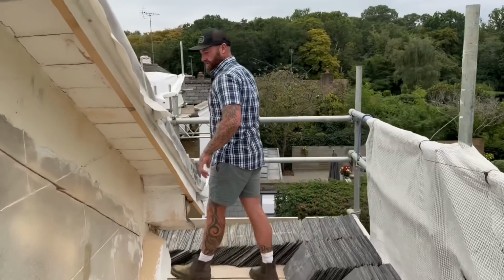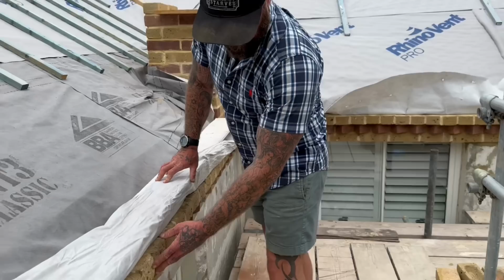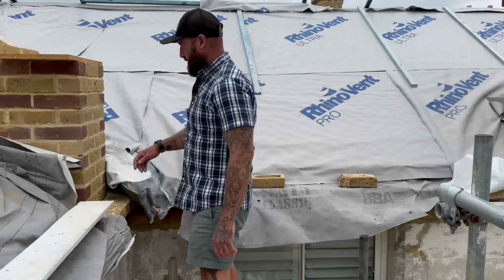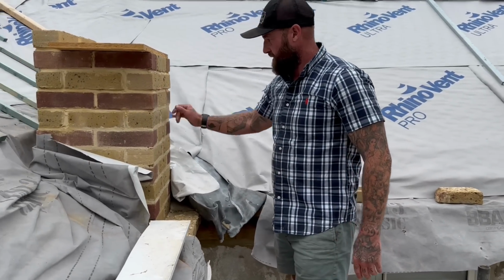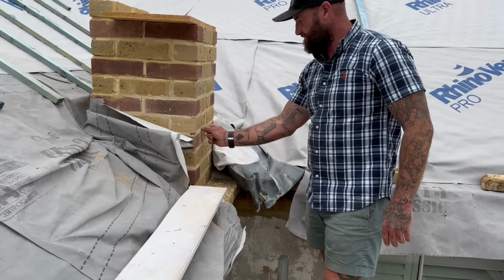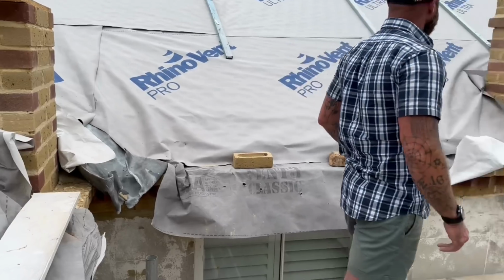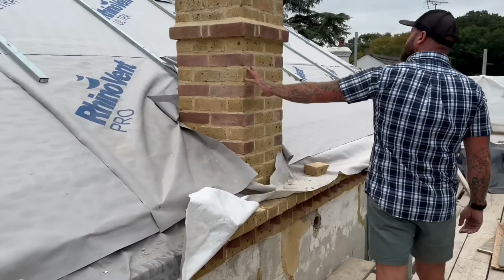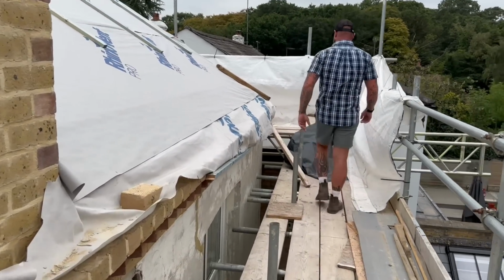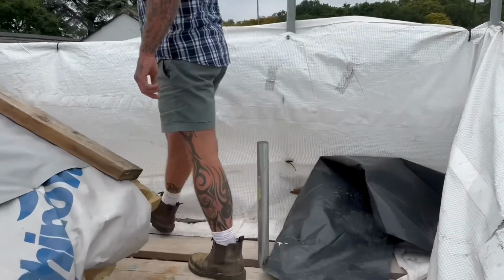Go around to the rear elevation. Again you've got the detail going around the head of the build, all needs to come up, stacks down. What they were doing, they were raking the joint out, and it almost looks like they were sponging it in. It's a lime mix, they were sponging it in. So this will come down. All this head will come through. Jump up here.